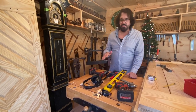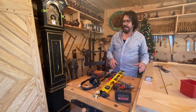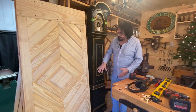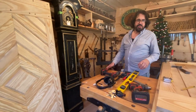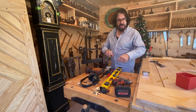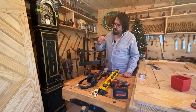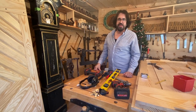It's going to take some time, but I want to get through the woodworking first on all three of these, hang them in their respective frames, and then go back and put the nails in. Then they go into some kind of a finishing process with a lot of filling. Gaps were filled in the period — just like a boat builder would do with oakum: reeds twisted into a twine or rope, submerged in a tarry mixture, then forced into all the gaps. That would waterproof everything, particularly the large gaps.